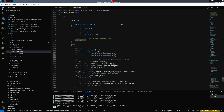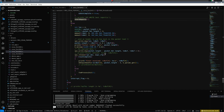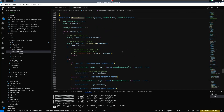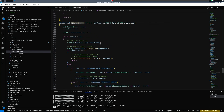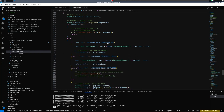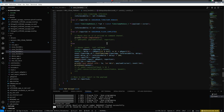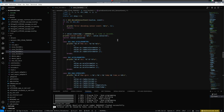If it's past the initial state, it starts to write data to the system and then reads that data back. Once it reads the data, we process the messages — the reset is flagged as complete and then we process the initialization. This is the SH2 input handler, which handles the payload type, timestamp, and how to calculate all the data, because we're ultimately generating quaternions. Once processed, a print event outputs the recorded data.